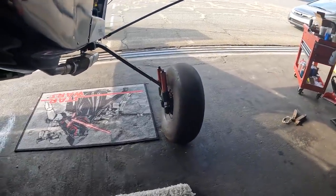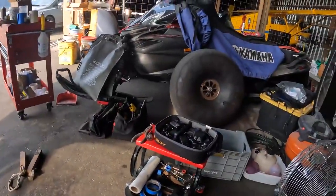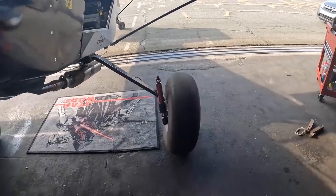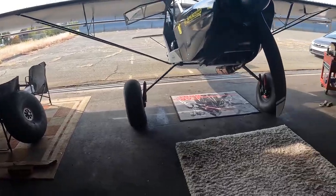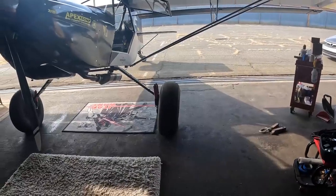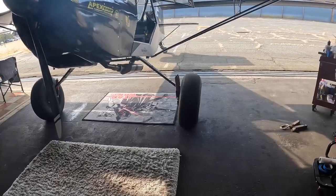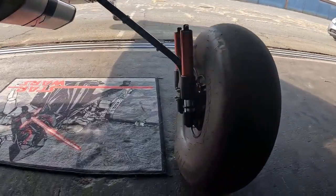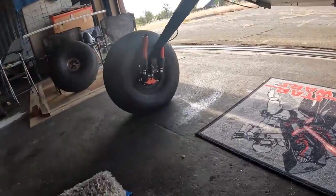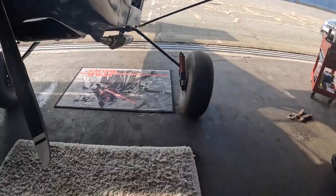Here's the 27.5-inch on there — it's got much better clearance. Looking at the pictures of the 29s, I think with the 29-inch bush wheel tire we're going to need to run a spacer. But a 27.5-inch or an Alaska Bush Wheel 26-inch is going to fit the new shock wheel no problem. Other than that, just going to go see if they behave pretty much like the other ones. They're down at 69 PSI right now in the shock, a little bit lower than what we were running in the smaller shock wheel — we were running about 80 in those. They do compress fully during taxi — actually not quite; you can see this rubber washer right here that shows how far it compressed, same thing on the other side. I've got cameras pointing at the shock wheel. We'll go fly the pattern, do some landings, and see how they do.